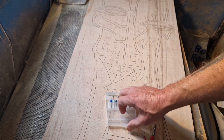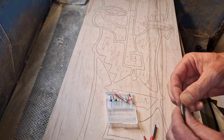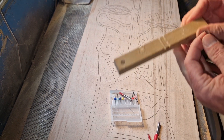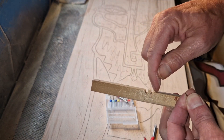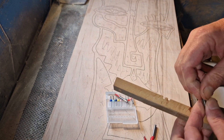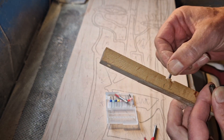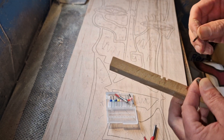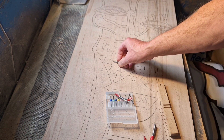We'll set the depth to about 3 millimeters. I've marked it off on a piece of wood — I'll set my router on top with the bit inside and set it to that depth. That's nicely the same thickness as the adapter, so that's our depth. That's plenty enough for routing out and popping our resin inside. Okay, let's pop this in the router, set it to 3 millimeters and start routing this one out.